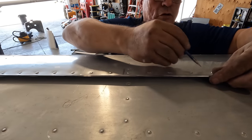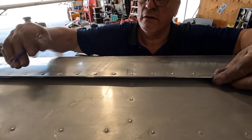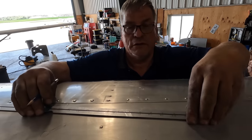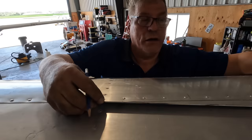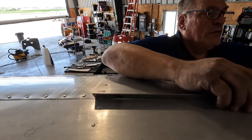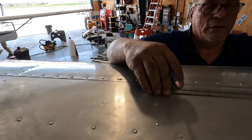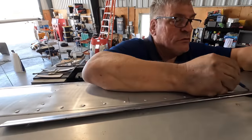We split for the doubler. The doublers come like this and go like that. Okay. That's they hold the strap here and here too. That's a splice. And so you need to drill out these rivets here on the top. From there to there, that's 24 inches strap. I have to remove all rivet here, from there to here. And between, we divide by two.